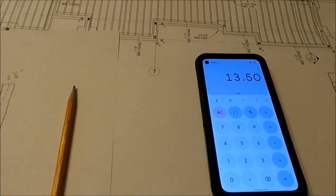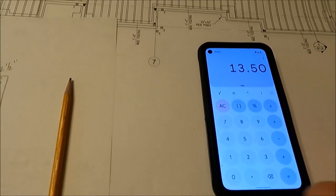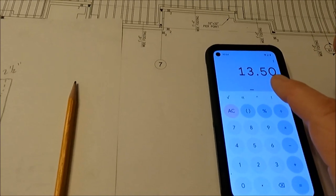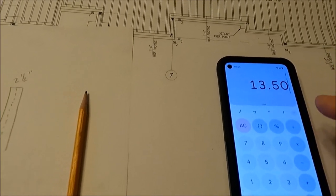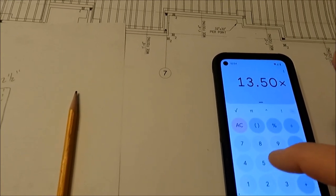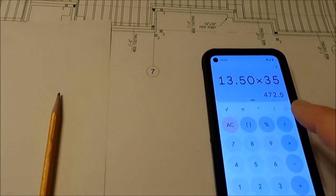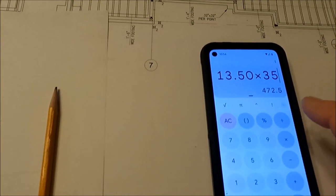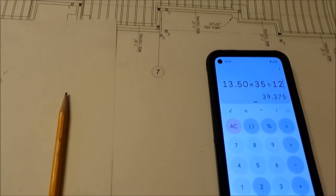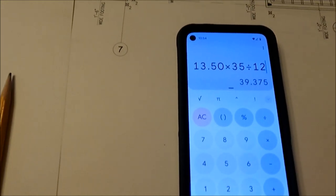So trying to get somewhat close to an even number for ordering extra I-joists to cut these blocks. So I took the 13.5 inches times 35 blocks for a total of 472 inches. So if I divide that by 12, that'll give me how many feet long the I-joist needs to be, and that's 39.375,